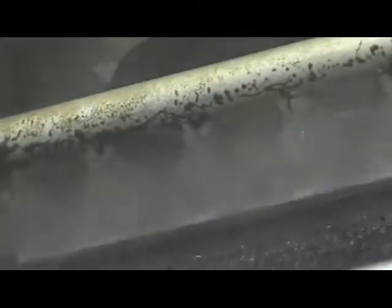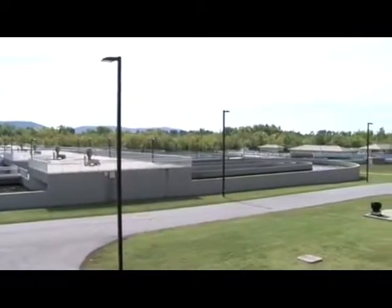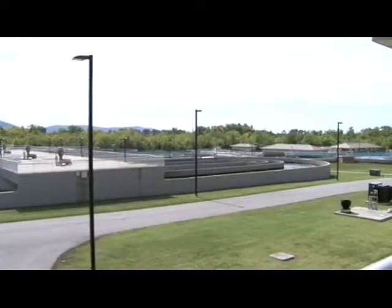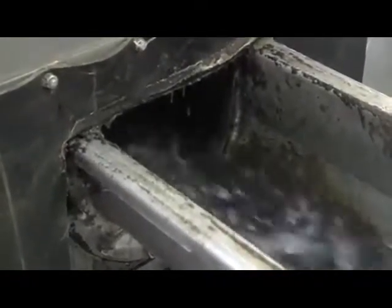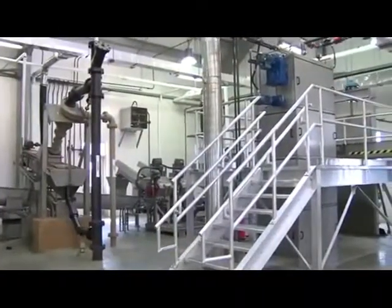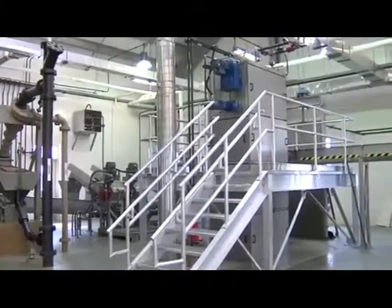It helps prevent deragging of pumps. Labor-wise, if we didn't have this system we'd be pulling pumps and pulling debris from pumps — especially the big rocks that would pass through during a heavy rain event. The rocks would flush through and get clogged up in our impellers on the downstream system. Last April's rain event, we put 19 to 20 MGD through just the screen alone.